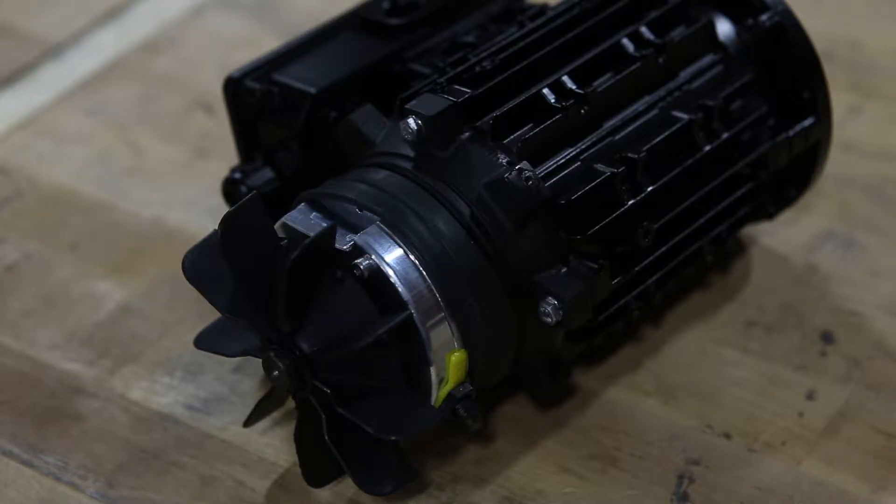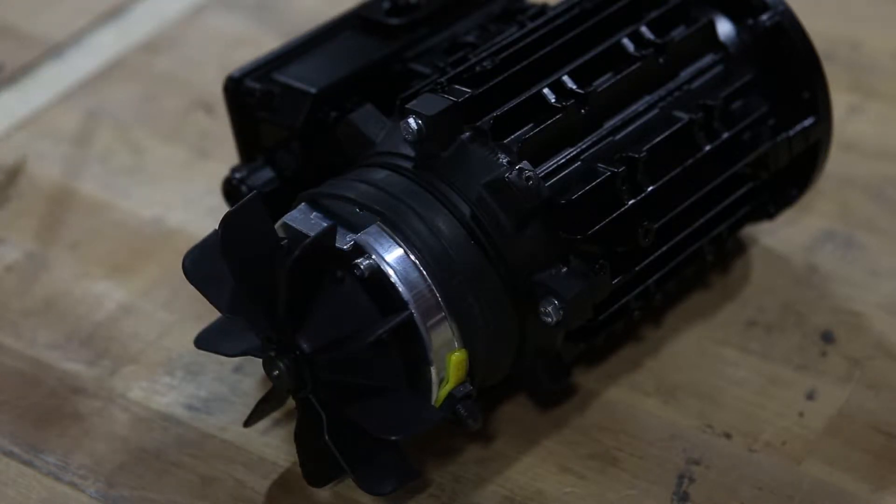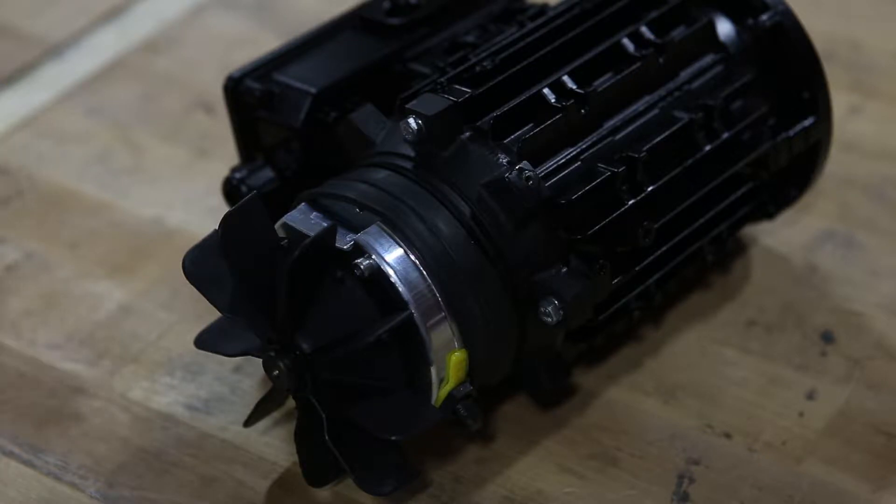The brake is located between the fan wheel and the bearing bracket of the drive motor. The brake must be visually inspected every two million applications or once a year, whichever comes first. It should be checked for correct functioning, wear, mechanical faults, and also dirt and debris.